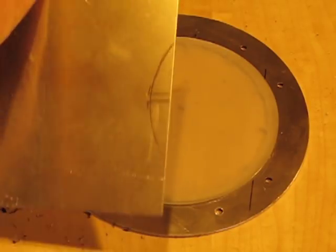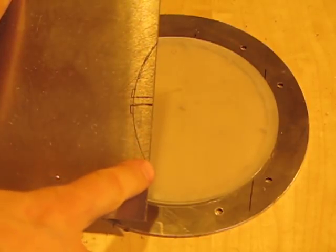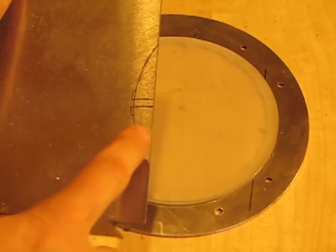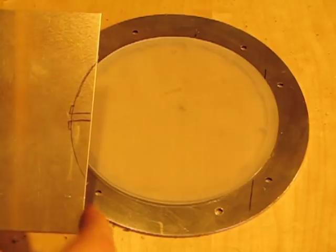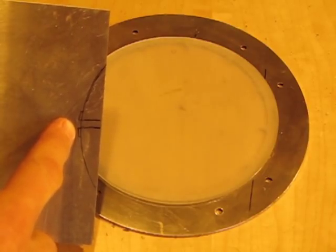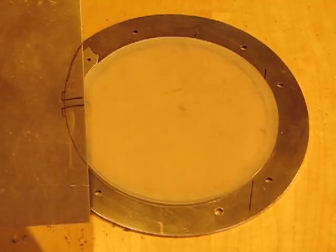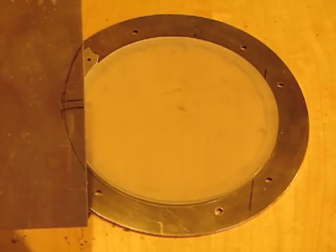The way I'm doing that is just taking a thin piece of aluminum and tracing the edge of the circle of the glass, with a little tab coming out here. This tab is actually too long — I'll cut it off after I bend it. I have some little tiny recesses after the edge of the glass so that when this bends up, it still won't be hitting it, because I want it to fit snugly against this curve.